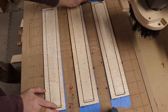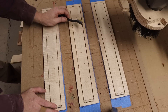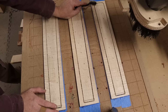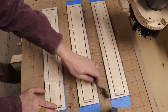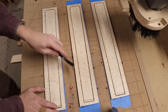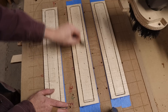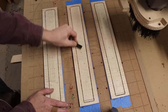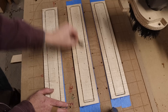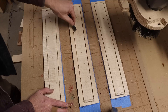First I did my quarter-inch toolpath finishing pass to give it the shape, then I ran all of my eighth-inch end mill passes which give me the holes, the profile, the nut slot, and all that. But really all I wanted to do was do that finish pass and get these holes in - I just did the rest for efficiency. Because I want to get epoxy into these holes before I go home tonight, so I'm going to use this wire brush to just clean up these holes.